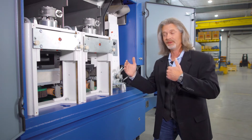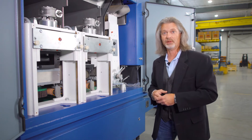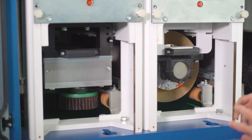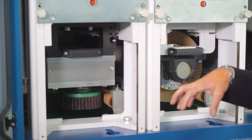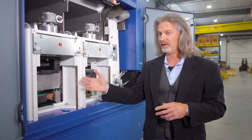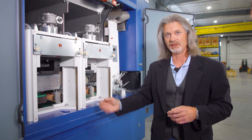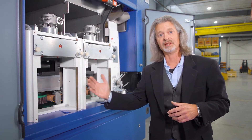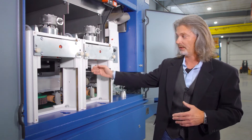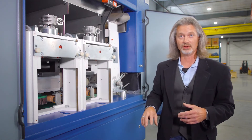Leading edge and trailing edge should be the same, and the lateral edges as well, with all of your contours deburred at the same time. This head has what we call a top brush, whereas the barrel brush is a cylinder — these are cup-style brushes, six-inch diameter brushes, with seven of them across a 37-inch wide machine. These are bi-directional: you can spin them in either direction, and the head oscillates as well — it goes left and right as it's spinning. Same for the barrel brush. These heads are all able to oscillate or not; you can turn that feature on or off.